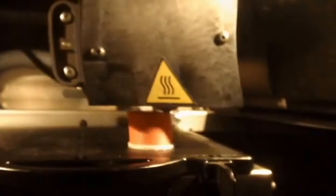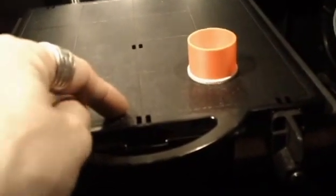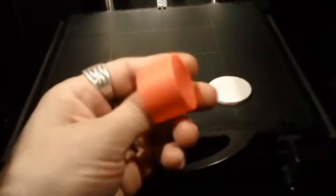It's built up pretty high there, and the part isn't much bigger than that. There we go — now it's complete. The build tray will cycle down to the bottom of the build compartment. You'll hear a click, and that is the door unlocking. Now that the door is unlocked, you can open it up. There's our finished part — you can take this out. I've found it's best to take them off the build tray as soon as it finishes building, or as close to that as possible, because the build tray remains warm.